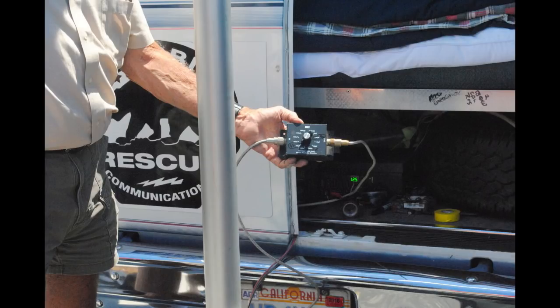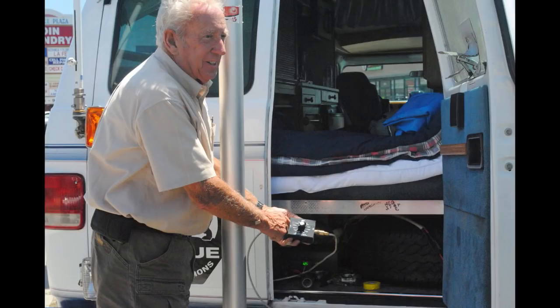And you click, click, click with an antenna analyzer, see where it takes a nosedive on frequency, and that is what you want to write down in your logbook. So when you plan to play radio for a little while, you go back aft, set it to the correct band tap, and you're ready to roll. Well, that requires checking all the different band taps for those of you that are going capacitors shunt to ground. If you're doing the coils shunt to ground,